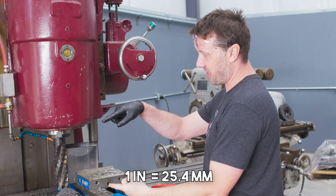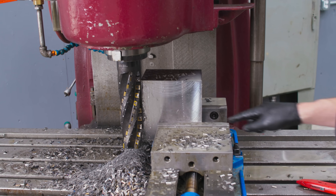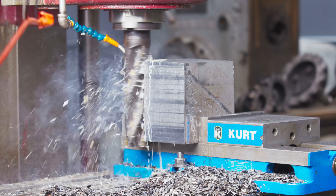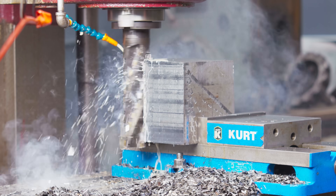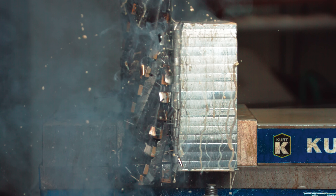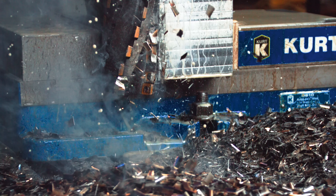That was fun — one inch wide, seven inches deep, running at two and five-eighths inches per minute. I don't think we should stop there, so let's try an inch and a half on the next pass. I also want to see if I can tell a difference between climb milling and conventional milling, so let's switch it up. I'm running into a rigidity issue — there's quite a bit of chatter, so next time I need to really look at my speeds and feeds. But it is still cutting very well — just look at those huge chips. I also think the inserts are dull, which could be contributing to the chatter. That would be a really fun experiment: try all new inserts and run the same cut again.